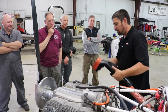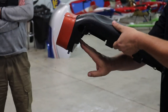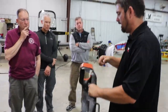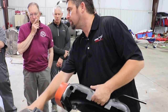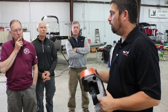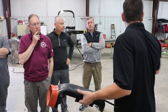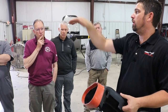The other part that's really important is this front baffle right here — see how it comes up about halfway on the air duct. That is not installed by Jabiru; you have to do that as a builder. It's pretty easy — you glue it to the backside, bond it on with some epoxy and flox. What it does is come up about halfway up the cylinder to make sure all the air goes up into the top. I've had builders not put that in because they thought they were restricting airflow. What happens if you don't put it in: 50% of your air goes under and 50% goes over, so number one and number two stay really cool but the rest get really hot. When you look inside an engine with air ducts on, you can see it comes up about half the radius of the cylinder, keeping all the airflow on top.